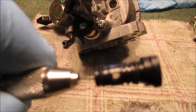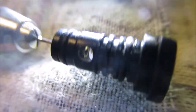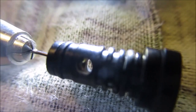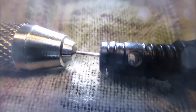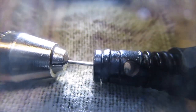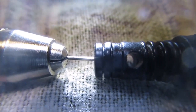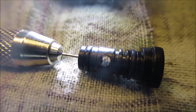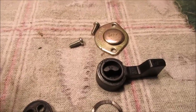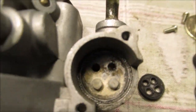You have to trust me on this one — the tip of the sewing needle just started to come out. I'm not forcing it anymore. I don't have a drill bit that small. Don't break off a sewing needle or straight pin like you use when hemming — it's hard steel and will snap on you. Don't use them to clean windshield wiper squirters on a car and break it off either. Okay, back to work. This is one of the main problems — that's why we're showing more of it. Here's your fuel shutoff — the rubber thing goes in there first; you've got two spare holes on it.